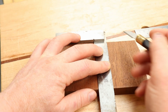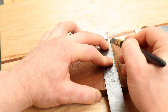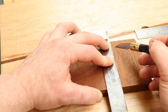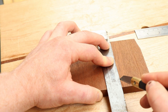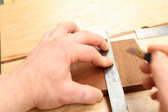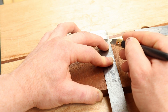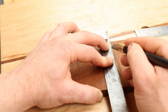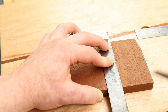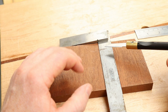When squaring your line across, it's nice and simple - drop your knife right onto your mark, slide your square up to it, and pull your line across. One thing to note with these thin blades is they will follow the grain, so if you lean heavy you can end up coming out with the grain and then back in. Light passes first, then get deeper and deeper. If you want to build a knife wall, a couple of light passes to establish your line and then deepen it up. It's more of a technique thing than a problem with the knife.